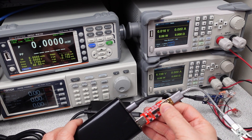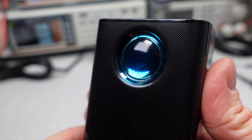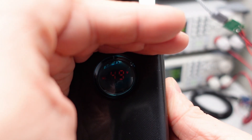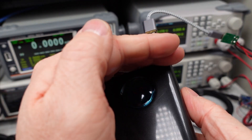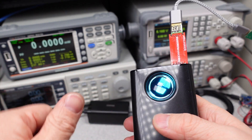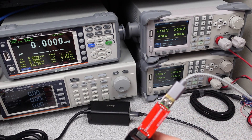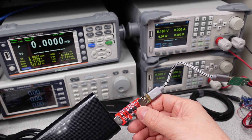The voltages all stay within the tolerances of the USB power delivery specification, which is a nice thing to see. Something that isn't so nice to see is the bubble display — I can almost never read this display, especially in bright lighting. I don't know why this would make it past the proof-of-concept stage. The display is also inaccurate by a fairly large margin: the voltage displayed was always about 5% low, and the current was also low by about 5%. This device does not have an always-on output voltage — if the load is light enough, the device will turn off the output after a few seconds. There is detection so any new plug-in will turn the device on, but pushing the power button again won't wake the power port back up, so you do have to unplug and plug it back in.